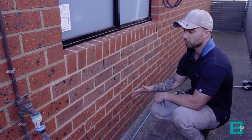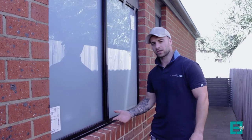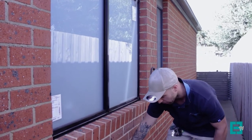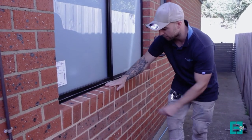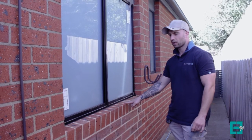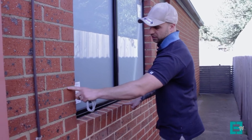Now, what we've done, we wanted to be able to install a bathtub on the other side of this window, so the window could have remained in the same position, which was lower. So we built it up, as you can see, to the new sill height here. We've matched it fairly well with the existing, but you can see there's just a slight variation because this is